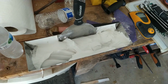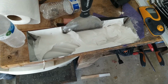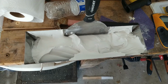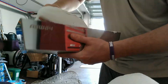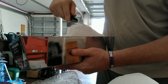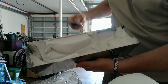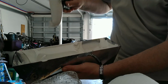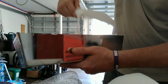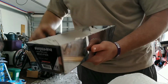I was getting ready to tape joints, I'll show you that later. I'd probably mix a lot more water in there, but this is just for the patch. We don't need it to be silky smooth. All right, that's about good. We don't need it falling off the knife or anything for this. Normally if we're taping, we'd want it to drip out, but this is nice and creamy. It's nice and smooth when you lay a line down like that. Should be good to go.